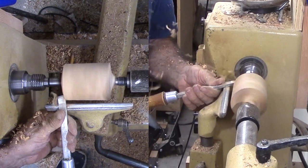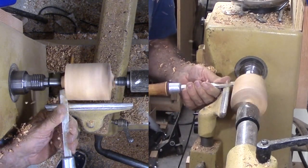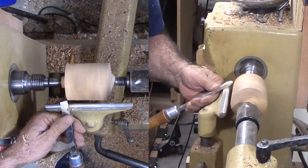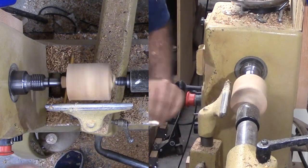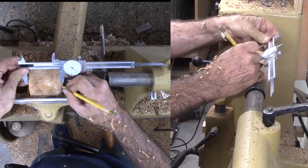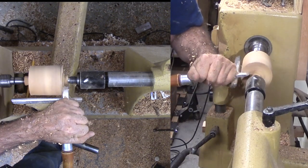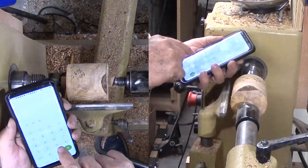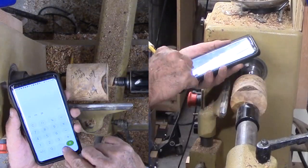I have prepared a piece of dry plum with a lot of burl-type grain. The plum seems to be very hard and very dry. I have turned it down to a point where the length is greater than the diameter, and it is still mounted between centers. My first task is to trim the end near the headstock — the drive has bored into the wood and I want to cut it back enough that the damage will not be in the final sphere. Now I can measure the diameter and write that number on my woodturner's notepad. Next, mark that same measure as the length of the cylinder, then trim back the end at the tailstock. This is a peeling cut with my skew, which works despite the tough, inconsistent wood.